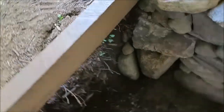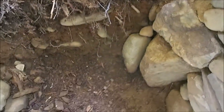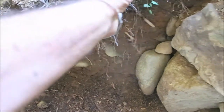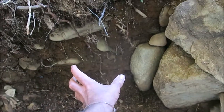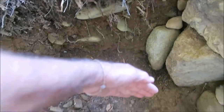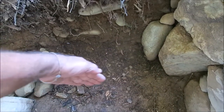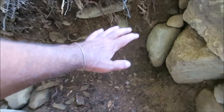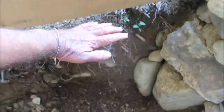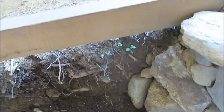So they are down behind where the rock wall will eventually be. The rock wall is going to come across this way. The vent will come down behind, through the dirt behind, turn and come out to be flush with the edge of where the rock wall will eventually be. So then the weight of rock will just be on top of the vent box here up to the height of where the rocks stop, and then logs on top of that.